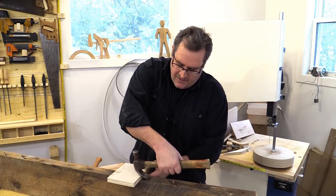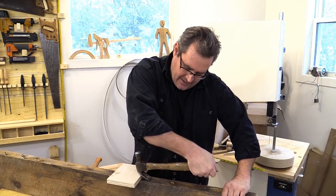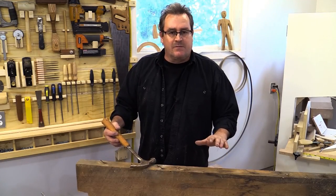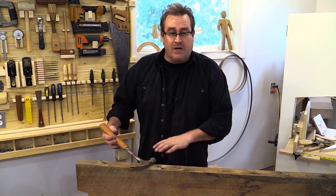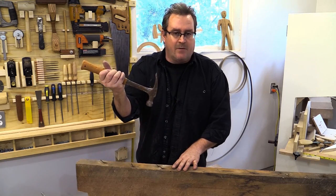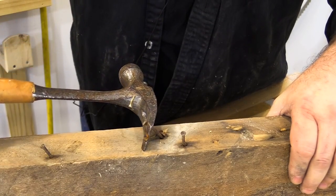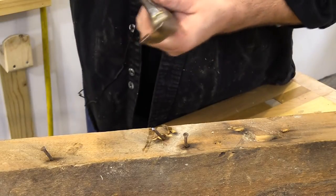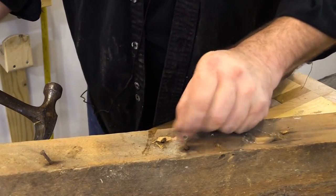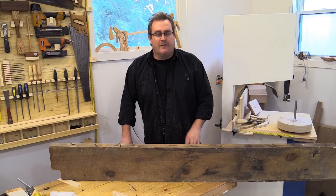Another way to make pulling nails easier is to use a block to increase your leverage — get it underneath the body of the hammer, get your claw underneath the nail. In this case you don't want to bang it too much, just pull it out evenly, and with the extra leverage it should come a lot easier. In extreme circumstances where you don't have room to swing or place a block, the straight clawed hammer comes in really handy. You can get it in on the nail, push it in tight, then wrench it sideways to pull the nail up. Go back and forth until it comes out — it does damage the wood a little bit, but if all you're concerned about is getting the nails out, that's not an issue.